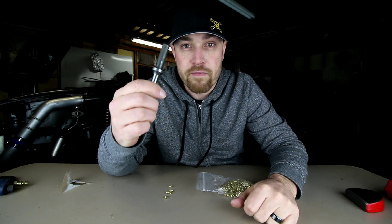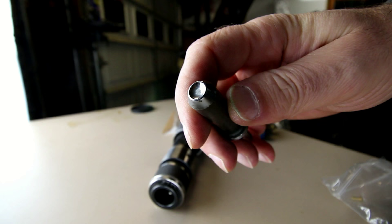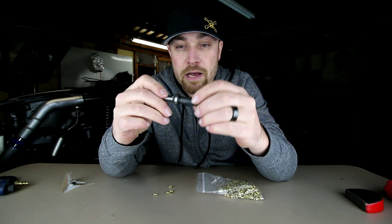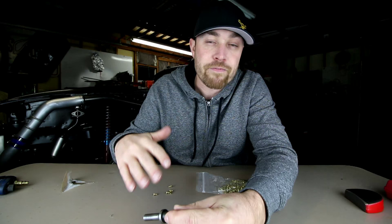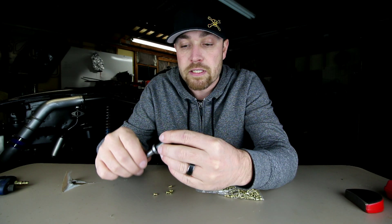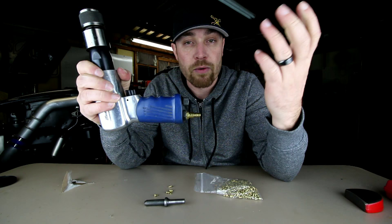It's quite simple. On one end you have this piece. On the end of it, it's domed just like the rivet is. This piece here - it looks familiar to a lot of you I'm sure - goes in an air hammer. Now, you could use an air chisel, but it's not recommended. The air chisels usually have too much power; they're too fast. You kind of want something that's specifically made for the aircraft rivets - it's a little slower and you have a lot more control. They are a little more expensive, but you can buy these pieces separately if you already have one, or if you have an air chisel that you can dial down. The particular one I've got is a Blue Point and it does have a regulator on it where you can dial it down a little bit, and it works well.